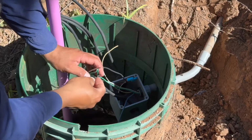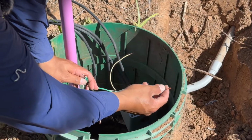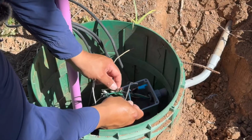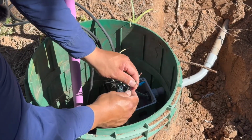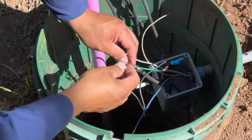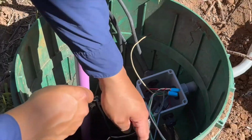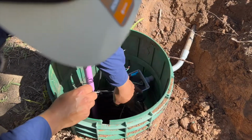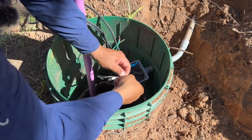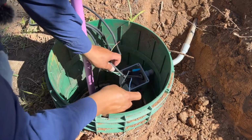That's basically it. Now, if you had to pull an override float, or let's say a pump test wire, then you would just tie this one to your pump hot, which is this guy here, like so. But on this system, we're not doing that. So all I'm going to do is I'm going to disconnect my hot from the float, and connect my pump float to my 2 pump float designated wires.